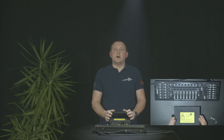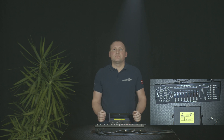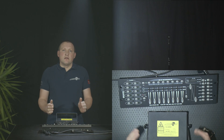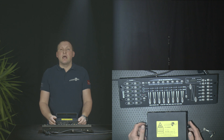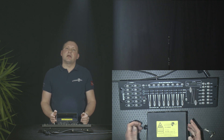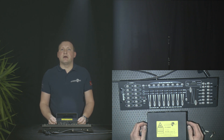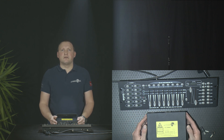Welcome. This is a video about how to use a basic DMX controller to control a basic laser system. This time we'll have the LaserWorld EL230 RGB laser system — a basic laser system for effects mainly — and we have a basic DMX controller with eight channels plus a second page, so 16 channels per device, and some basic programming features. I have the Eurolight one here, but there are similar products from other manufacturers that work very similarly, so this is a very generic video that applies to a lot of different controllers out there.